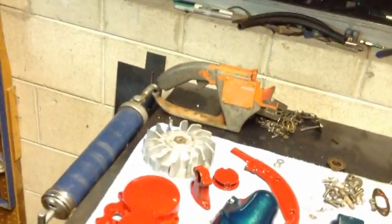I got the saw torn apart and soda blasted. I got a different handle for it because the original handle is broken at the end, so I'm going to pop the rivets out and swap the plates over. I've already popped the plate off of this one, and then I've got some small stuff to do before we get this old girl back together.